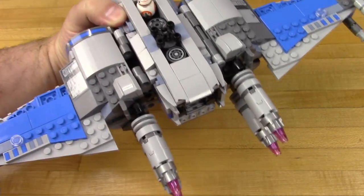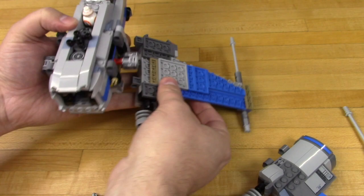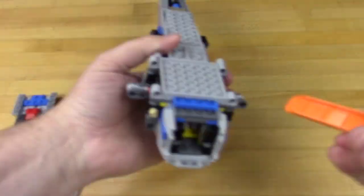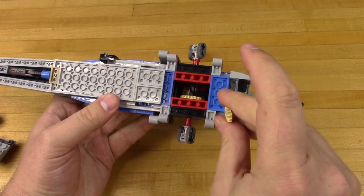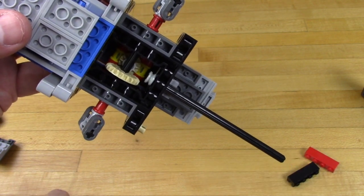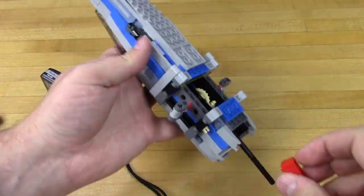We have to break out the internal gearing to come out the rear of the X-Wing. To do this, we have to disassemble a good portion of the bottom, which isn't too difficult, just obnoxious. The first thing you want to do is take off the wings by taking out these little clips on the rear. Next, remove as much of the bottom as you can until you see the internal gearing. You may need a LEGO tool or a screwdriver to get some of these parts off if they're on there pretty tight. We're going to use a small beveled gear and a very long rod to help break out the gearing to a right angle. Put a spacer on first before your beveled gear to keep everything nice and tight and secure on the inside. This is one of the most frustrating parts of the entire build, so if you're building your X-Wing from scratch, do this while building it — otherwise going back and doing it afterwards is annoying.